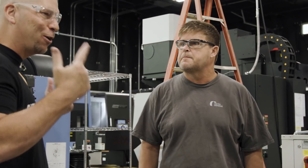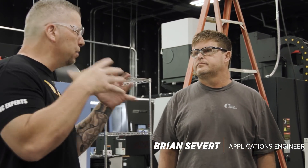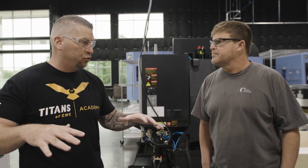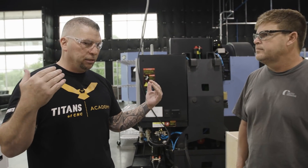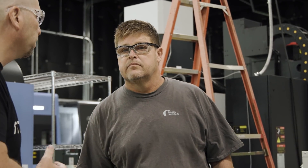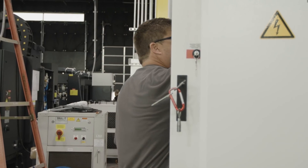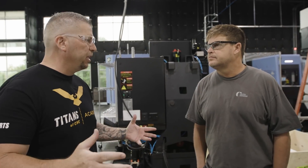One of the heroes of the game — this is Brian. He's been with United Grinding for six years. When a machine comes in, these machines are no joke. You've got some crazy foundations and everything has to be absolutely perfect. His job is to get components together, check the machine, qualify the machine, and make sure everything's top notch and start training right away. When looking at the foundation, we have three feet, and he's going to level those so everything is absolutely perfect.